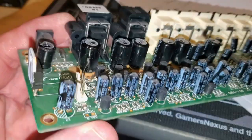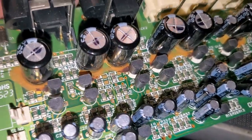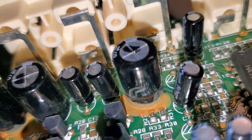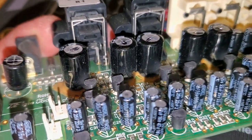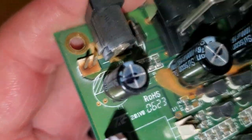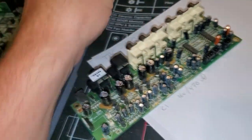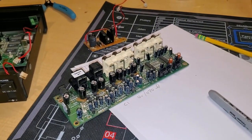Here's our main video board. Upon closer inspection, you can see all kinds of electrolytic fluid that's oozed out — check that orange residue out right there. Every one of these larger 16-volt 1000-microfarad caps has gone bad. Those are the most common ones to go bad. I'm going to pull these and test the other capacitors around here, but those are most likely the only ones. This one is also reading bad, so we're going to replace those. We'll get these caps removed, get the area cleaned up, and I'll come back and show you.